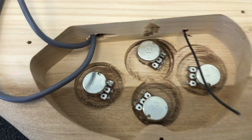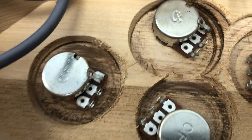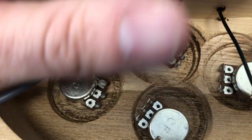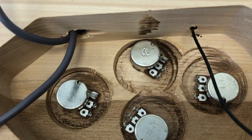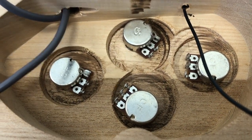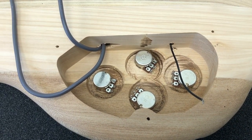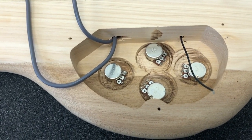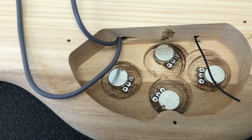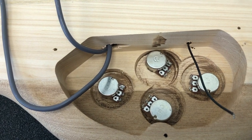On the volume pots, the third leg gets grounded to the back of itself, so we'll do that on both volume pots. We'll also do the bridge ground, the pickup grounds, and the output ground. One sanity check I like to do is just make sure that each ground is connected to every other ground one way or another — whether it goes through from one pot to the next or from a switch or whatever — just make sure all the grounds are connected to each other somehow.